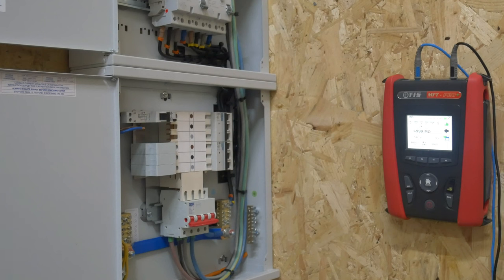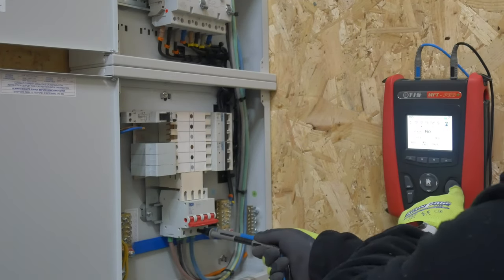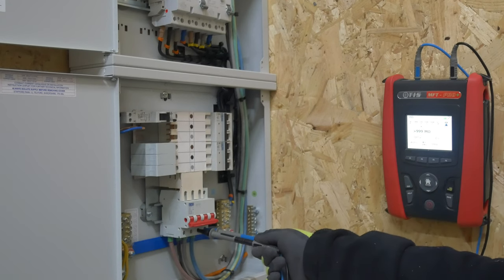We now need to do L1, L2 and L3 together between neutral. You can join them together at this end or the other end. I'm just going to zoom off to the other end and put them all in a little croc clip arrangement so they're connected together. They're joined together now at the other end of this arrangement. We can now check that we've got this done correctly at this end — we need to make our measurement between neutral and these. So basically if you go on any of the other ones, they're all joined together at the other end, linked out, and we're checking those to neutral — and we can see that that's clear.